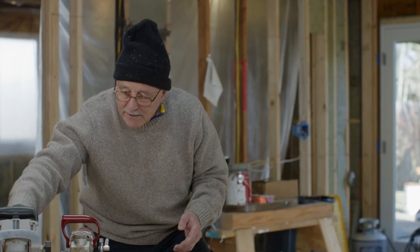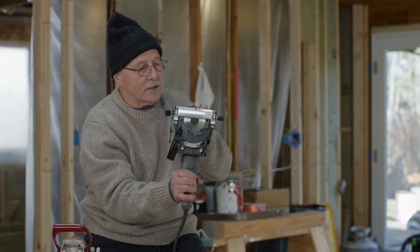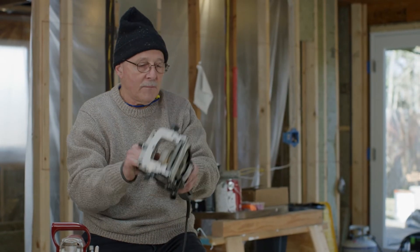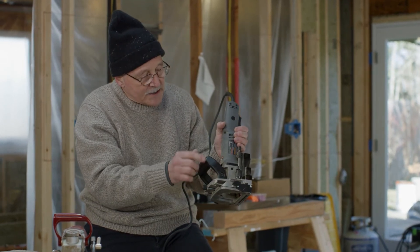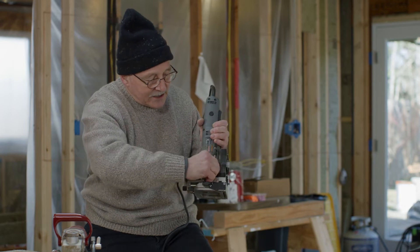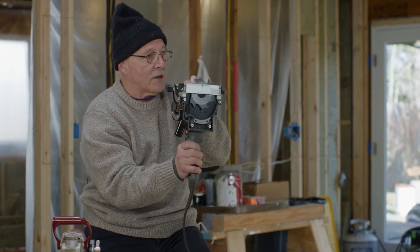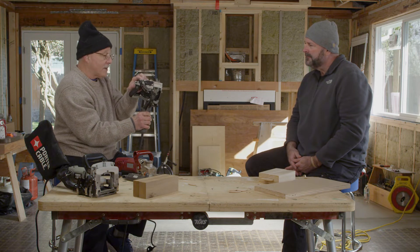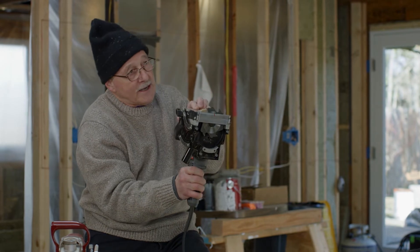There's actually a little blade in that tool — can you show us that? Sure. Essentially it's like an angle grinder and it's on a spring load. You can change how deep it goes by adjusting this small turret here. The turret goes up against the stop. This is set on a number 20. You can set it for maximum, and then you can see it goes all the way through. That looks like one of our rip blades — it's very aggressive. And you can also see at the back, in order not to have kickback, it's got that anti-kickback spur.